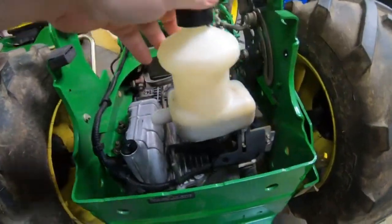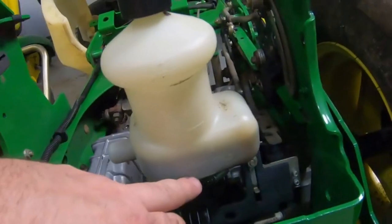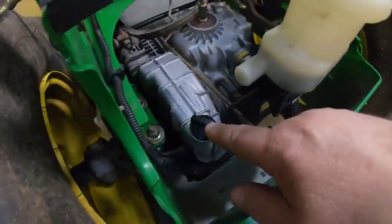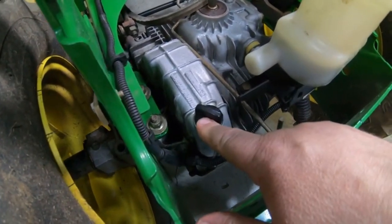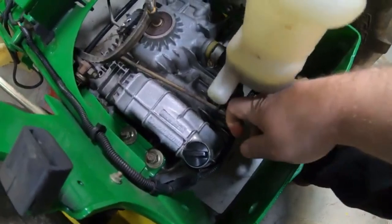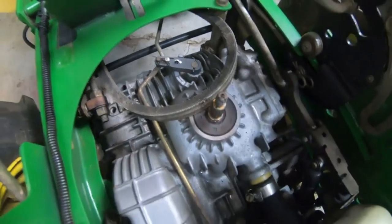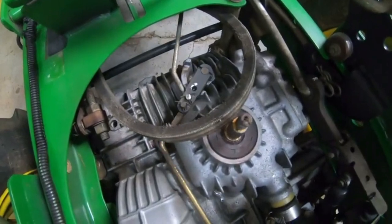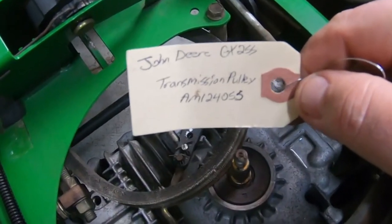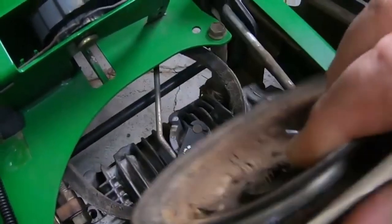Now we've got this all cleaned up — a little more fun to work on. I'll show you a couple other things to check while you're down in here. Your fluid line is about up to that line right there, and it's good as long as it's between the two lines. That's your add line down there. I would not recommend pulling this cap off while it's full because this is lower than the fill level and it'll actually run out. Also check this pull rod where you disengage your transmission to push it around — make sure there's no debris or sticks jammed down in here. I've bought tractors they said the transmission was bad on simply because something was jammed in there. This pulley part number is AM124055, available on Amazon and also Pro Parts Direct.